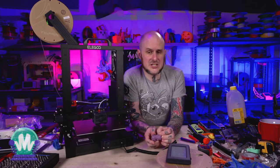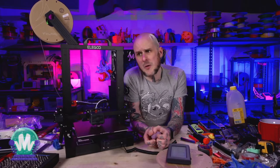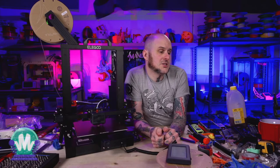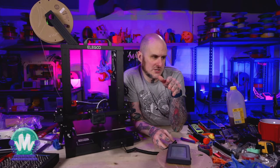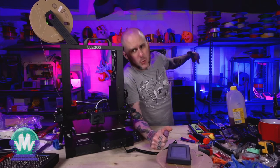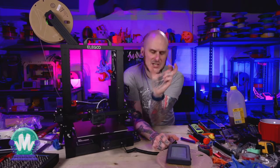Have I ever tried the double extrusion width on a 0.4 millimeter nozzle? I don't think I have. Are you liking the BQ H2? I like it. It's not the right thing for the Ender 5 Plus. I'm taking it off the Ender 5 Plus and putting it on my Cobra Max probably. So I like the BQ H2. It's not perfect, but it's a solid all-around direct drive setup. The noise of the traction annoys me, but I got used to it. The problem on the Ender 5 Plus or on a Core XY machine would be that it's so wide.